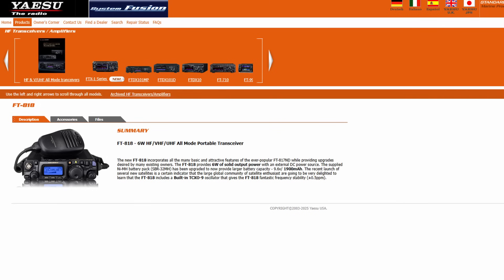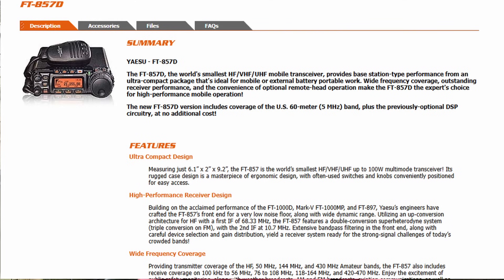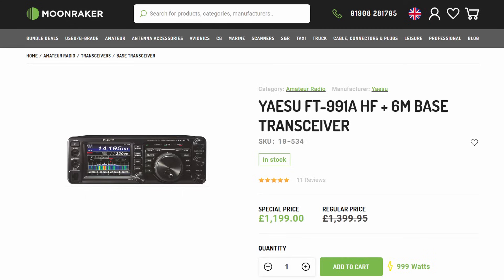100 watts from a DC power source would be required — the same as any other 100-watt radio needing around a 30-amp supply in order to drive it. And of course you get all the same benefits: USB-C interface and everything in one box. It seems to me that Yaesu have tried to be a bit clever with this radio, because not only have they tried to replace the FT817 or FT818, they've also looked to replace the FT857 — 100 watts on HF and 6, 50 watts on 2 and 70, supporting the ATAS antenna. And arguably they've also tried to replace the FT991 and 991A, given the radio includes C4FM and a waterfall display on the VHF/UHF bands.